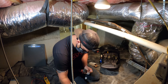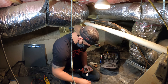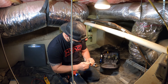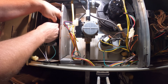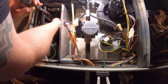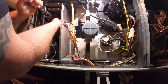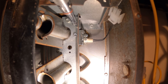I'm going to go ahead and get this new igniter installed. The new igniter came with quarter-inch head screws instead of the 5/16, which makes for a lot easier install in that burner assembly. There's a little lip there where you mount the hot surface igniter, and those 5/16 screws were just a little too big to get your drill in there. So it reinstalled a whole lot easier than it did coming out. I also noticed the front plate on that burner assembly was removed when I got there — it wasn't installed at all.